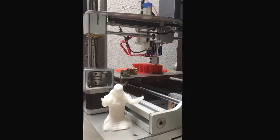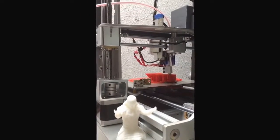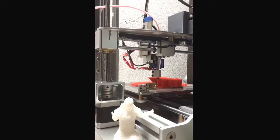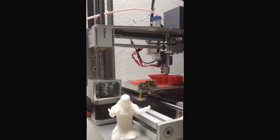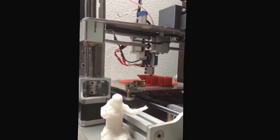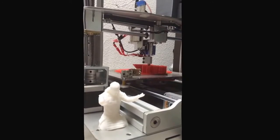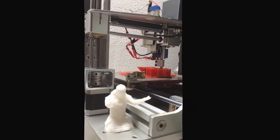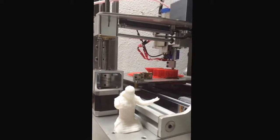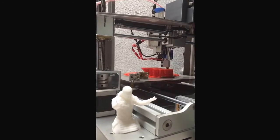Like I said, I've been going back and forth between the V6 and the Volcano. Right now I only have three of these kits — I ordered two of them with a .2mm nozzle and one with a .4mm. The .2mm gives really nice results on a print if you can get it to work, but it jams a lot more and it's a lot harder to print with. The .4mm is the standard pretty much.